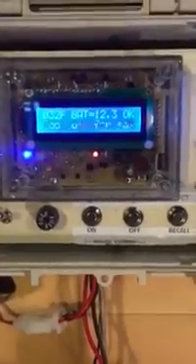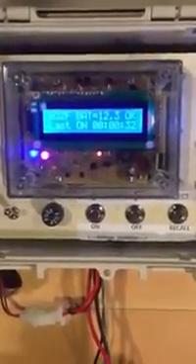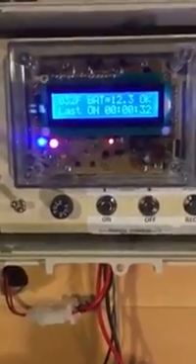Another one of the protection features is this switch and fuse, which are in series with the power feed for the pump. Now let's say something happens like I blow a fuse. What happened there was the pump obviously turned off because of the switch, but it recorded a power fault and also opened the bypass valve. So if your pump has a jam or something and blows a fuse, or even if the wire breaks, the controller will recognize that. You also saw a red light on there. And it'll open the bypass valve so that you don't lose any sap.